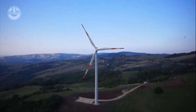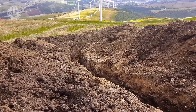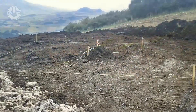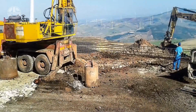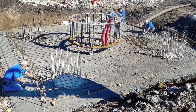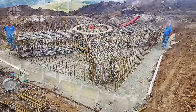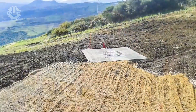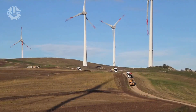Since they are very tall structures, they need to have a strong foundation to ensure their security. Workers need to build a sturdy foundation first so that there will be support for the turbine's components. They do this by clearing out a portion of the site and excavating it. The space should be enough for the turbine. Then, they pour concrete over it and embed steel reinforcements. Usually, the foundation consists of a reinforced concrete slab with multiple anchors that connect it to the tower.